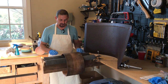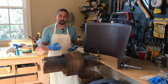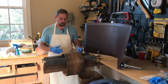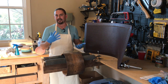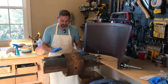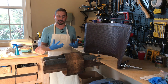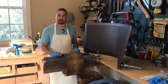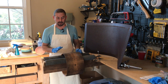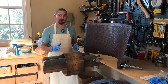I went around the whole shell two times — you might need more than that depending on how clean your finish is. With my other drum, after I went through it one time it revealed a lot of sags and runs — probably in one of the coats I put too much polyurethane on in one shot, and it made these little sags and bleeds that I didn't really see until I used this heavy cut compound. This drum looks a little bit more solid. Now since I went through this, I'm going to give it a few minutes just to cool down because you do add a little bit of friction and that heats up your finish. Then I'm going to take my rag, wipe this whole thing down, and make sure I get rid of all the abrasive.